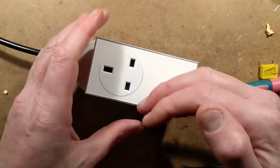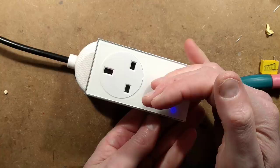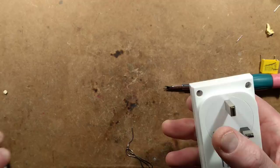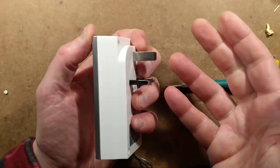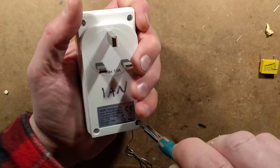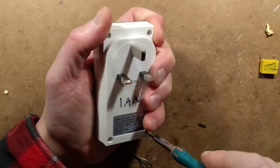When I plug this in, that orange indicator is brighter now. When I press this - I heard it click. And I didn't hear it click off. The unit is fixed, and that's all it takes. Did you notice how I put my finger over the contacts there just to check if there is a discharge resistor? This is a really common problem with these simple devices.